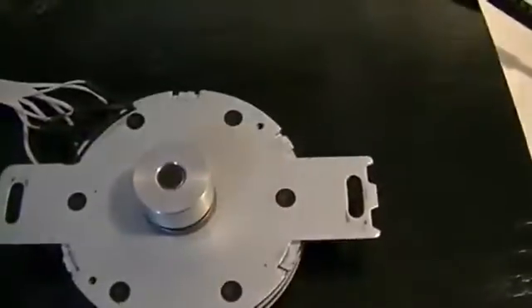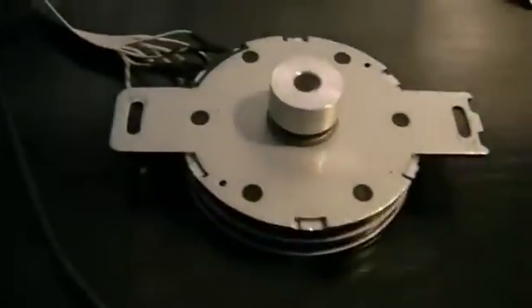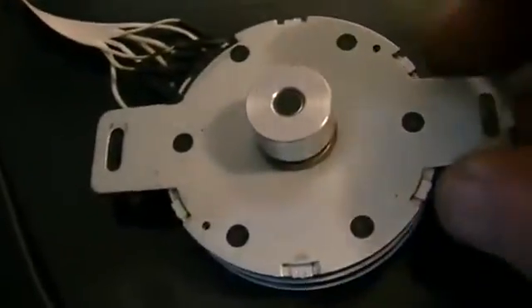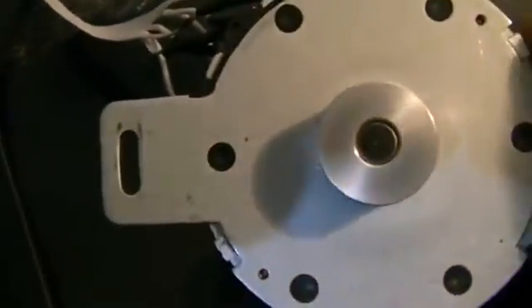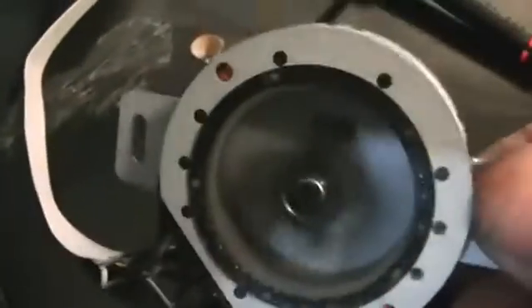Can't tune it much. Can't run it on any voltage lower than 20 volts. And the reason for that is because there's 36 ohms across each one of those coils — very high resistance. And the wire there is very small, which was a little headache and fiddly to strip cable onto those wires. But it does work, as we can see.